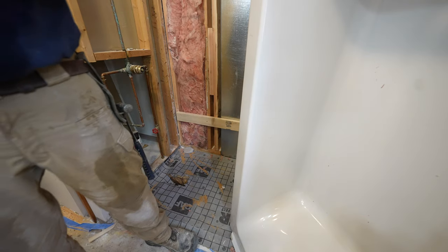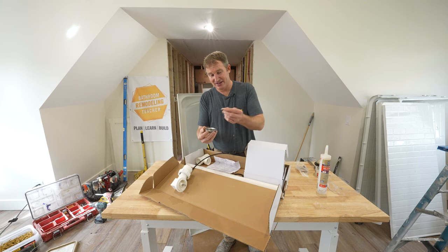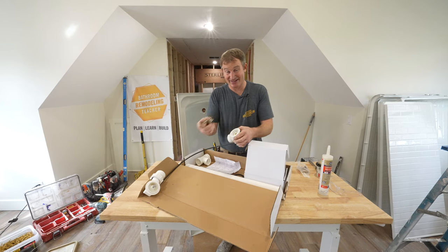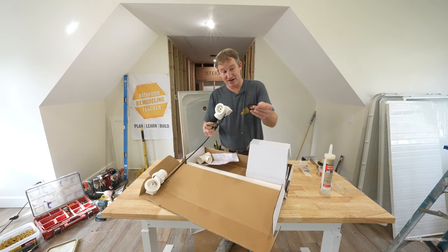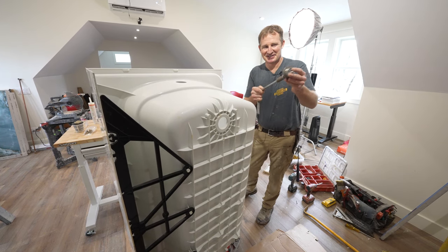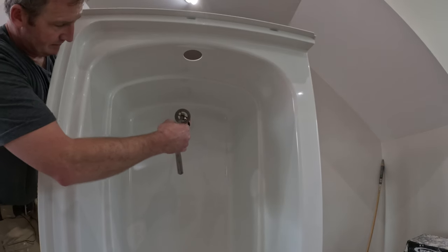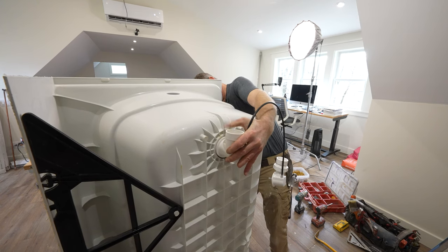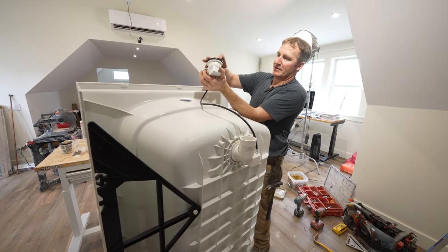What I love about this assembly is that it basically has a nut driver that connects it into the tub, so it's really easy to tighten down. You don't need a special tub drain tool — basically just need a ratchet. This also has the traditional rubber gasket on the back. If you're doing this by yourself, an extension will make this a lot easier.